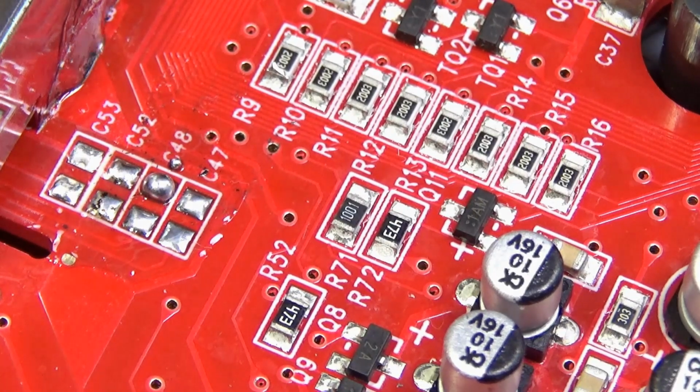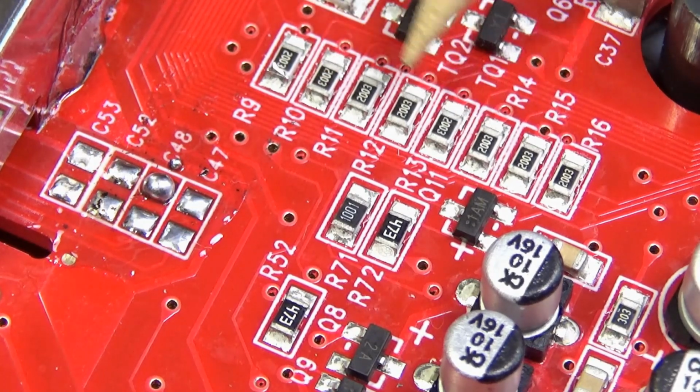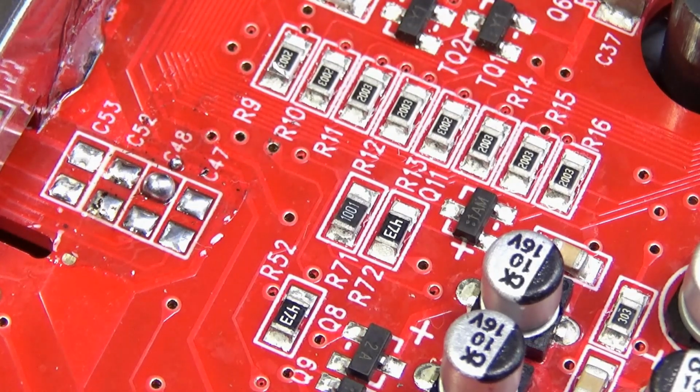Supposedly, in the industrial process, when we finish the SMT process, when we place the surface mount devices, we go later for the through-hole process. It's what happens most of the time. After that, we are able to wash the board, technically speaking. Some components do not allow the board to be washed after they are placed, so in that case, the board will remain with the flux there.